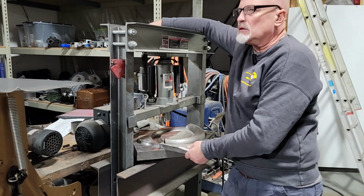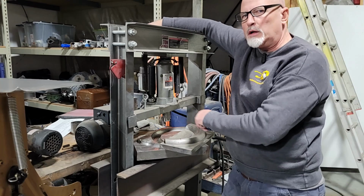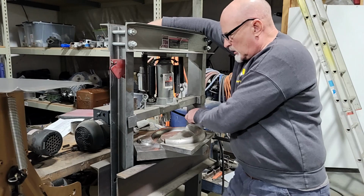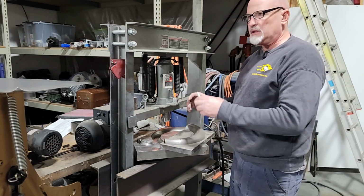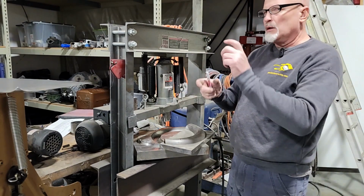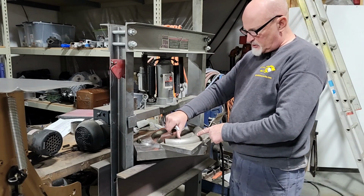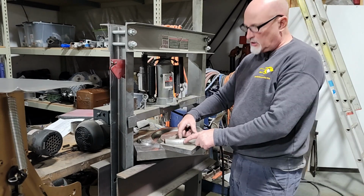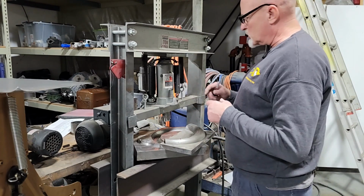So I machined these header molds. I made two of them, one that's 3 degrees and one that's 6 degrees. And I made them with enough variable through all of it that I can kind of mix and match, so 3 degrees going into 6 degrees, but I can use sections. I figured where these pipes are, this was the 3-inch section. So I need a section here, and then I've got ones marked out for the 6 degree, which I'll bend in a second.